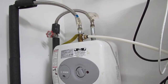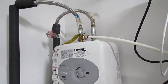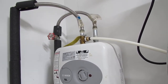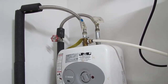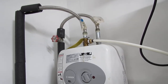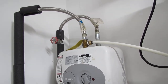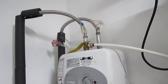What they do is put these smaller tanked water heaters underneath the kitchen sink to service just that one fixture. One thing to keep in mind: anytime you have a tanked water heater, regardless of size, it has to have some sort of expansion protection installed. You should see a tank on top of it, and if you don't have that tank, you could have what's called an expansion relief valve, which is designed to relieve the water heater of pressure due to thermal expansion.